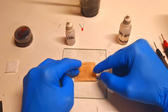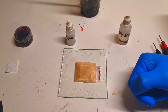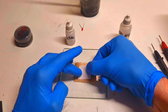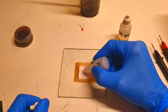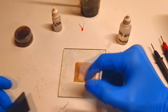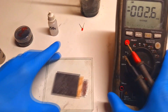For short testing, the baking paper works really well. But if you want to make a more professional dual electrolyte aluminum air battery or experiment longer, you will need to use a Nafion membrane. Baking paper will only last a couple of hours before you need to replace it. On top I will put the graphite plate — let's check the voltage.